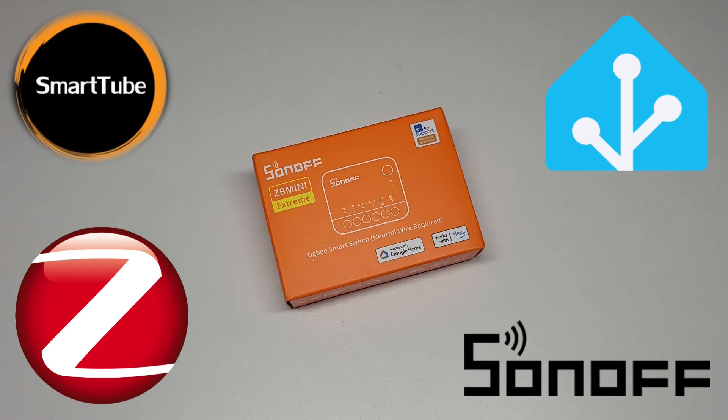So why would you need this device? It's a smart relay that you put behind the wall switch to control your lights. It can also work alongside your physical switch — you can turn on the light with the physical switch, but also remotely with your smartphone. Since this is a Zigbee device, you will require a gateway that connects to Wi-Fi.